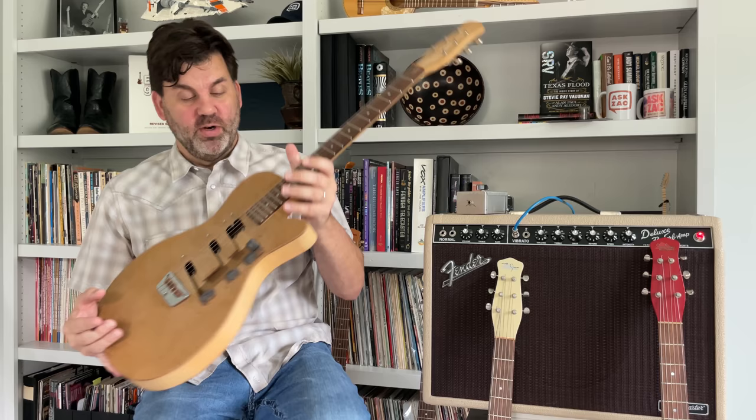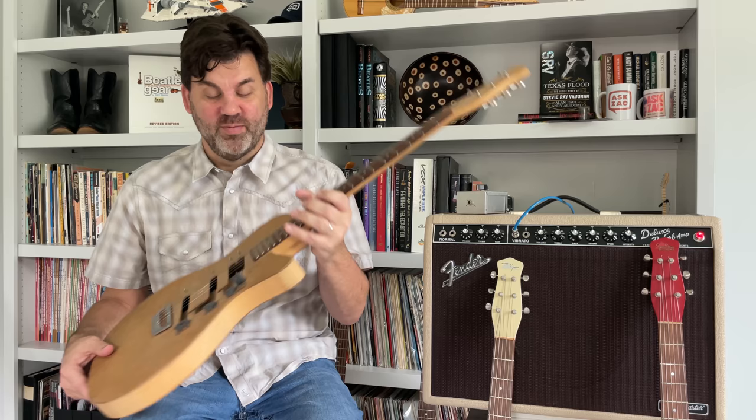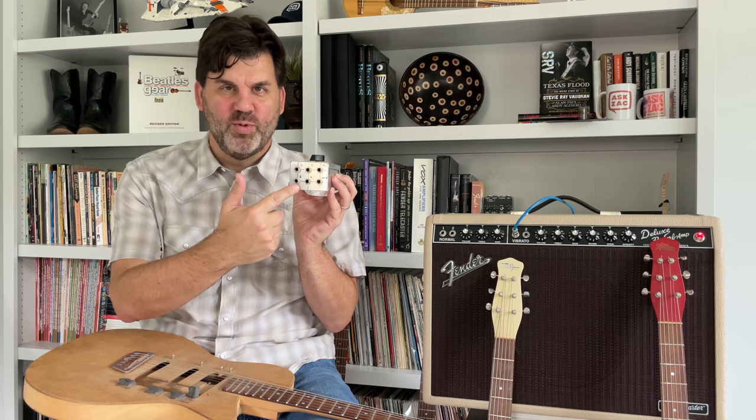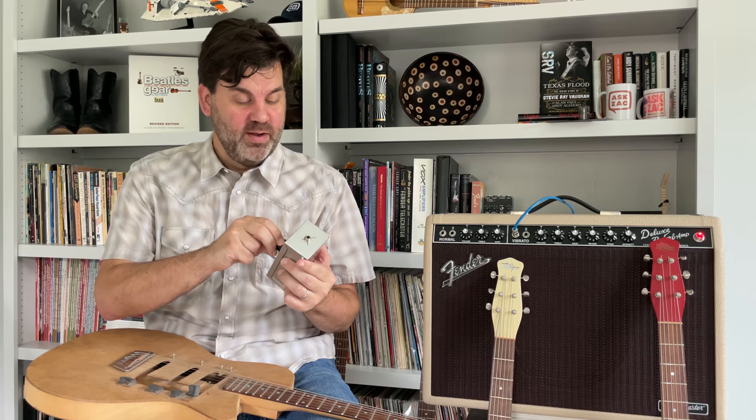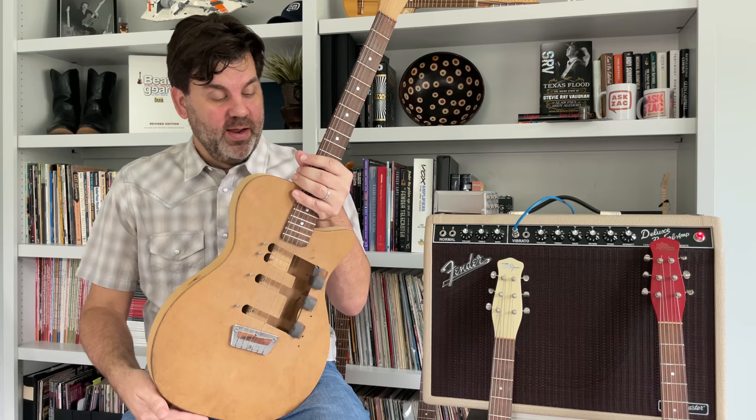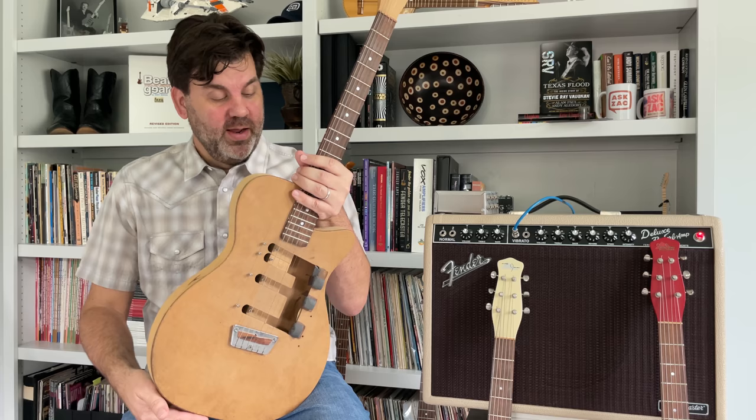The prototype has routed slots with rubber or felt padding so you can slide pickups in and out very quickly, because no one was making lipstick tube pickups in the 1980s — he had to make them himself. He started learning how to wind pickups and used this guitar to test them. Each pickup was wired up to a quarter-inch jack, then run to a rotary switch. All the pickups would be plugged in and you could quickly switch between them — the switch even says 'None' for off and 'Jones' — with the output going to your amp. This is what he used to dial in the sound and learn how to build these things.